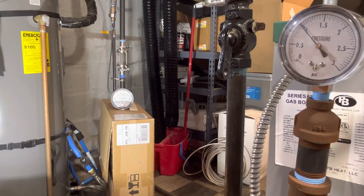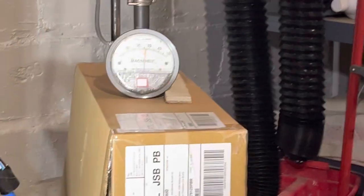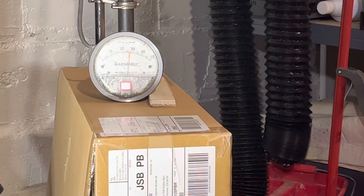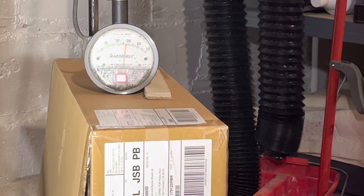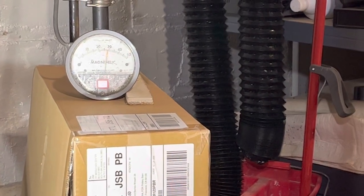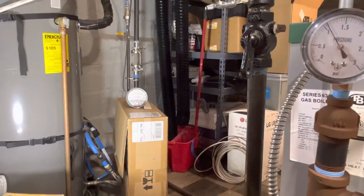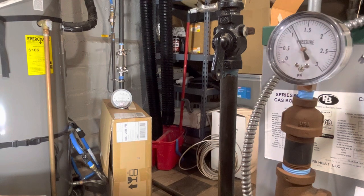Alright, we're at 1 psi at the boiler, and we're just crossing 26 inches of water column at the far side of the main. So I noticed this yesterday. Occasionally the pressure at the far end seems to be a little bit higher than I would expect, but it's only in the range of an inch or two of water